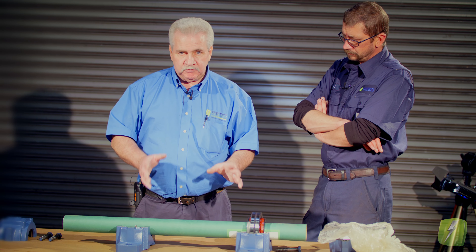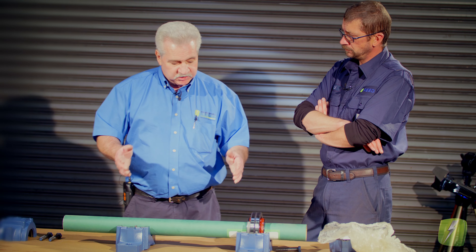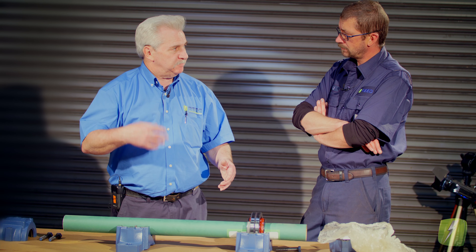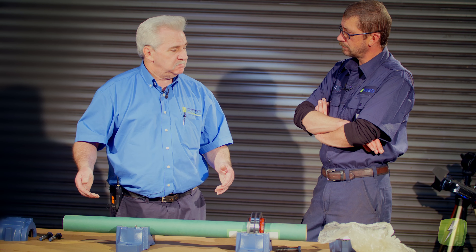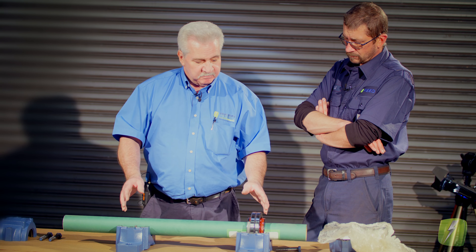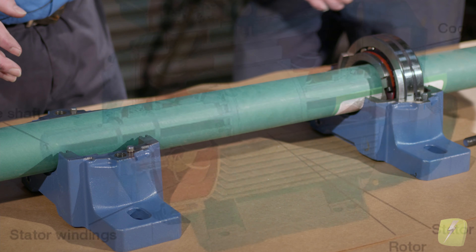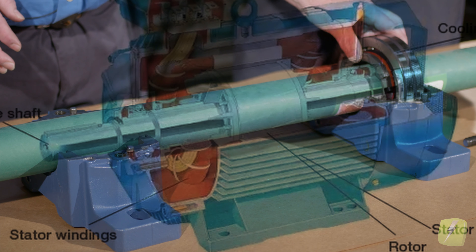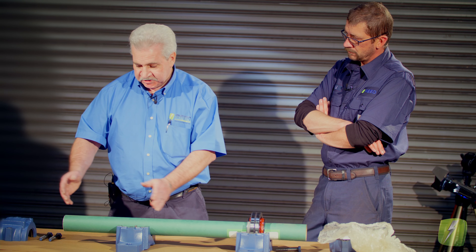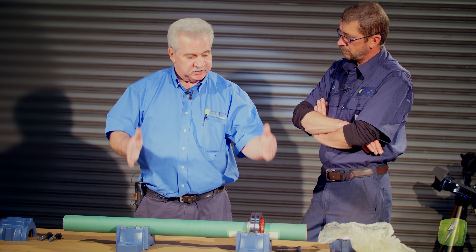Those are really, really good numbers at 10 and 15. So a 20-inch shaft is pretty much 20 thousandths until you start plugging in hotter values. It's a good practice to get into. Hopefully it makes sense — on a motor, clamping the opposite drive end and having it grow towards the shaft extension — you should be able to calculate the distance between the bearings.